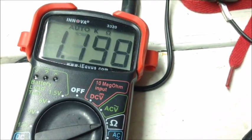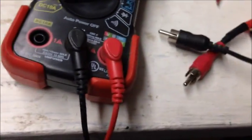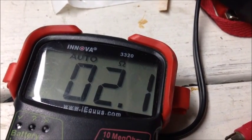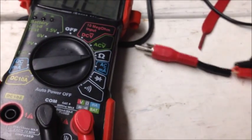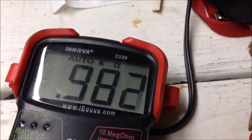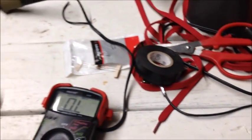Now I'm measuring the ohms — it's about 1K, which matches these 1K ohm resistors. This other connector doesn't register any resistance, hardly any at all. But this summing cable will now register 1K ohms on each side. That's to prevent the outputs from blowing up on the mixer or the equalizer.